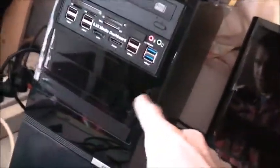Anyway, I'm going to proceed to change the rest of these caps. I sort of let it down, so let's change them all. Got 1, 2, 3, 4, 5. They're just all on the 5 and 12 volt rail there, because they're bulged. What would happen is you try to turn it on, and it'll be on for about 2 seconds and go off, and it'll go zzz, zzz, make an oscillating sound. So those were shorting out, stressing out the power supply, and it was shutting itself off, protecting itself.